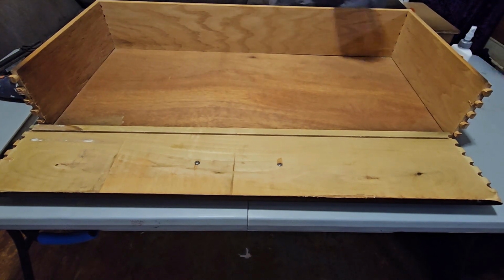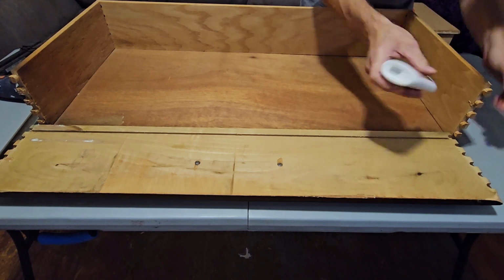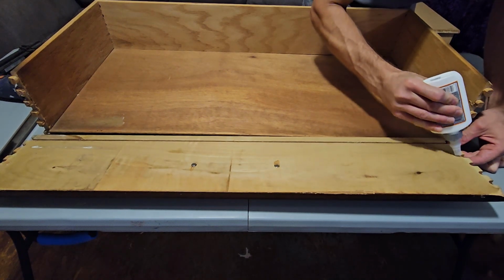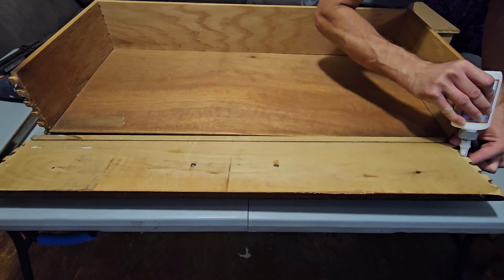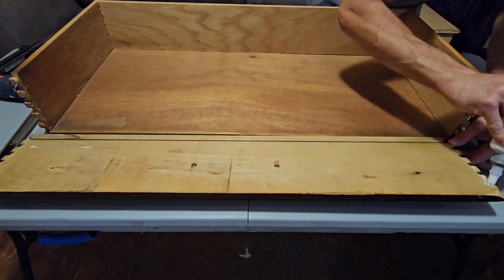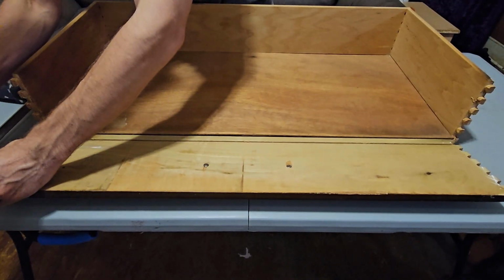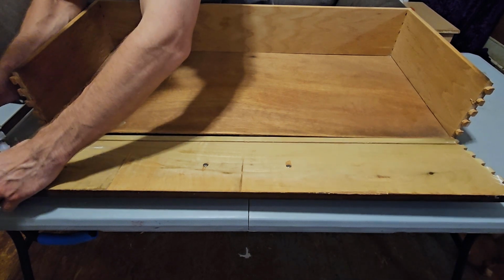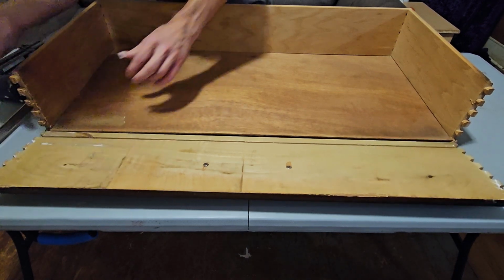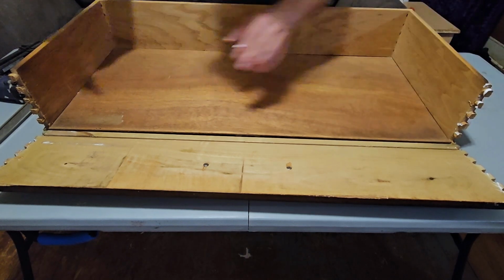Then we're going to put on our safety glasses just so you don't squirt anything in your eyes, or so that this way you don't have an accident with the staple gun or something like that. And you want to put the glue in the different grooves, or you could even squirt it on a plate if you're going to use the brush to be able to do that. I'm going to squirt some in both sides. You want it in the drawer face and you want it on the drawer itself, so this way it gets a really good bond. I don't have the best vision, so if you guys see me messing up, it's the fact that I'm trying to see.